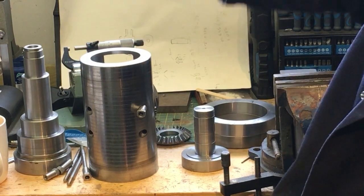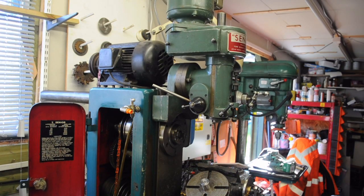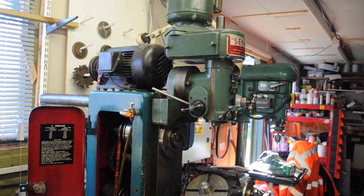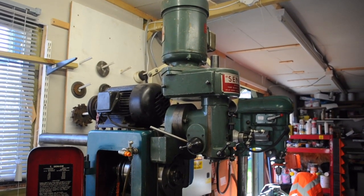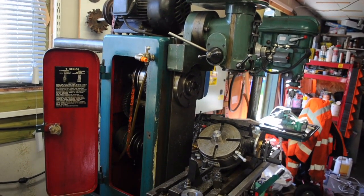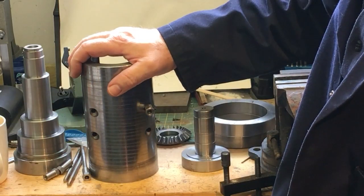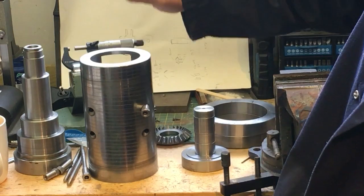This is a vertical head, or will be a vertical head, for my horizontal milling machine — it's a Tom Senior M1, a lovely piece of kit. I have got the powered vertical head, the S type head, also a lovely piece of equipment, but it does have two disadvantages: its lowest speed is 500 RPM and the spindle taper is 2 Morse taper. I could do something that will take slightly bigger cuts, so not being able to find anything, I've decided to make one.